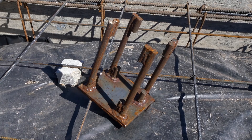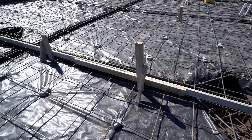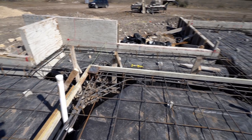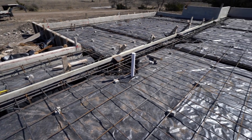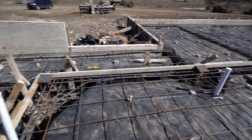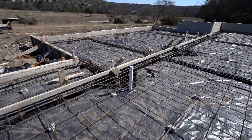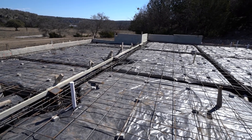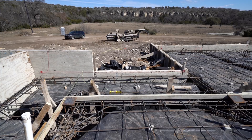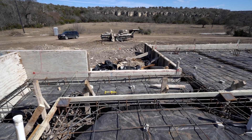So everywhere you see an anchor plate, we're going to have a support column for our metal building. Right under there, we have a big pier with a lot more rebar. We're going to have one there, one there, another there, one more, and then one in the corner. The spacing between these two plates is 10 feet, the next two is 12, the next two is 15 feet, and the last one I believe is 10 feet. We try to keep our bay spacing around 15 feet — sometimes we go a foot over or so, which is okay, but we try to keep them pretty short.